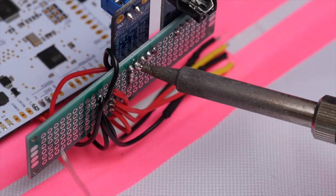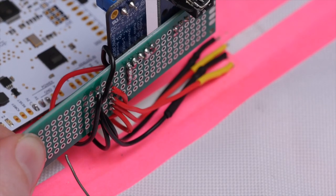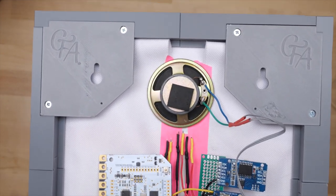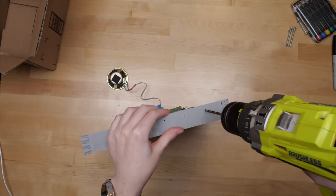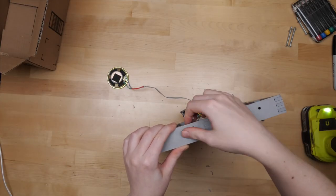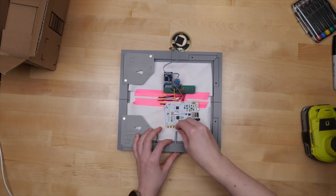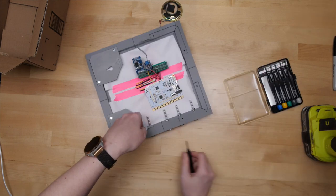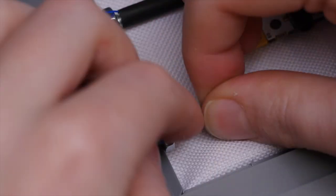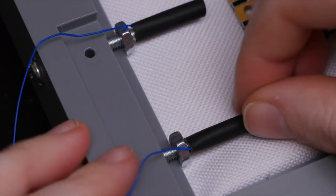To play the sound, I attached an audio amplifier and a speaker. I found a few different songs to put on the SD card. To extend the touch sensor contacts to the outside of the frame, I drilled holes through it and installed a few bolts and nuts. To connect to the touch board, I twisted small wires around the bolts and then applied some heat shrink tubing to hold it all in place.